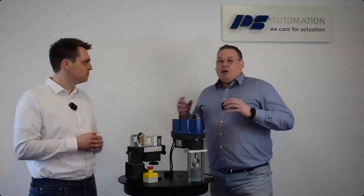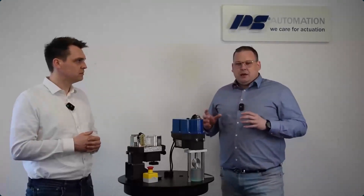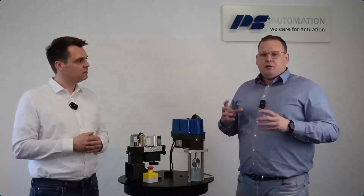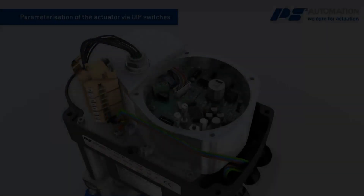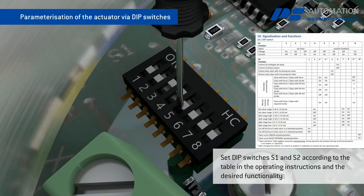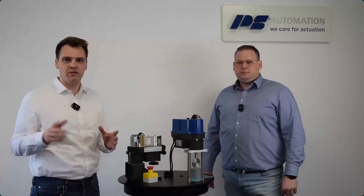There is mechanical fail-safe moving counterclockwise or clockwise, and handwheel operation on both actuators. The PSF QM can also have its actuation speed adjusted. Three control modes come as standard: 4–20 mA, 0–10 V, and binary input. Wide-range power from 24 volts up to 230 volts. Settings are made via DIP switches — a short tutorial video shows how to adjust them and set the operating direction, set value, and feedback.